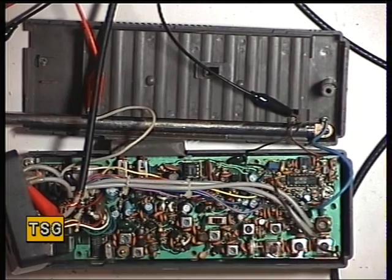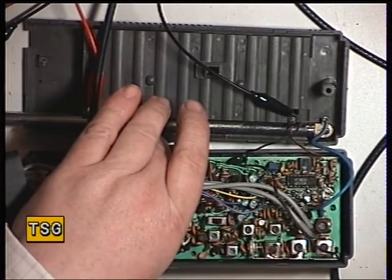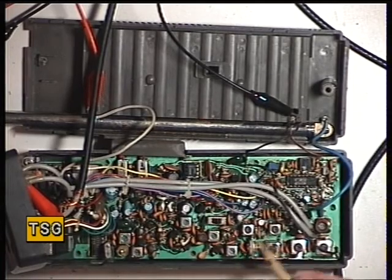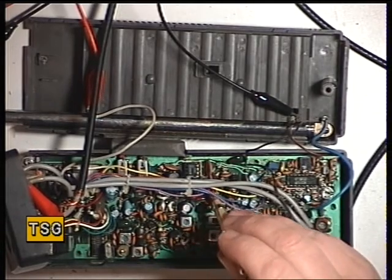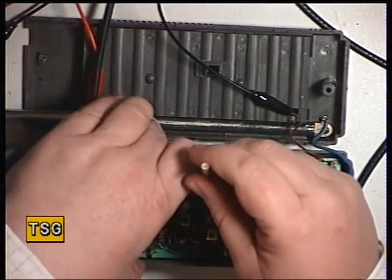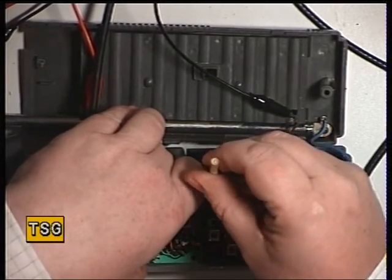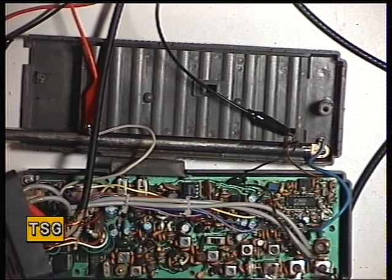That's variable resistor 1. This will be novel. All I can do is really the whistle test, and that's well over the top. So again, that's been screwdrivered. VR1 is the deviation, and VR1 looks to be that one there. And there we have it, 2.2. That's okay. So that sets up the transmitter. So the next video will deal with the receiver.